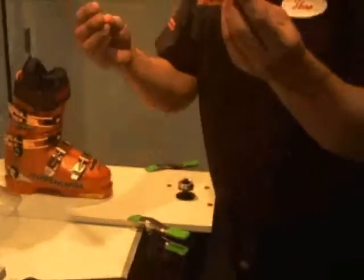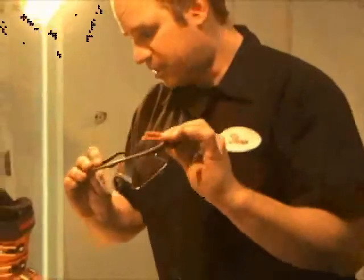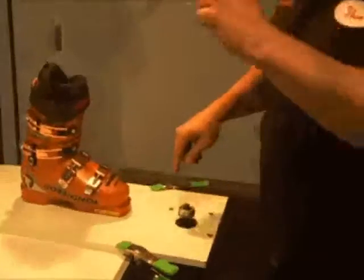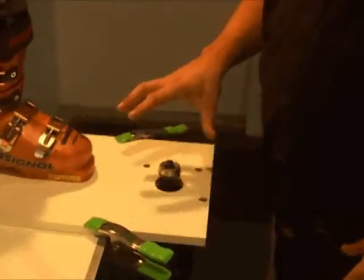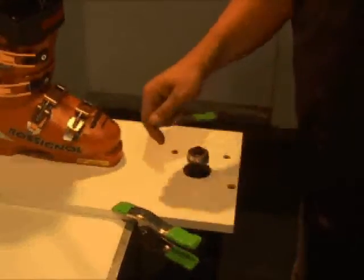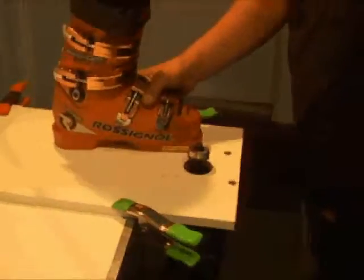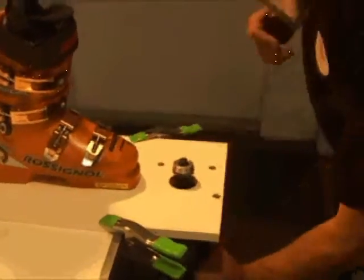Make sure to wear all of your safety gear — you're going to want to wear your ear plugs. For eye protection, you can use standard eye protection, or I prefer the full face. The router bit is going to operate in a counterclockwise rotation. You always want to make sure that you run the boot against the router direction. Since my router runs counterclockwise, I will run the boot from left to right.